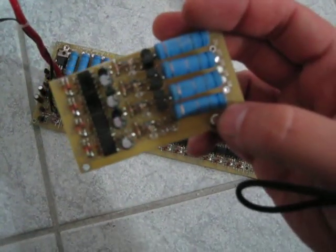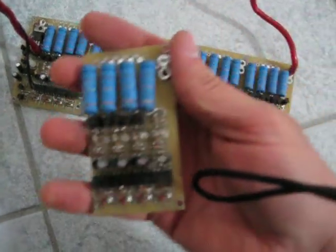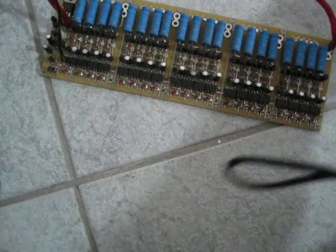So this is where you see the parts on the last channel — I took them off. I tried to use the board with the component missing, but it wouldn't work properly. So, considering you only need 20, I just cut it off. Believe it or not, this took me about an hour to figure out, because the missing components wouldn't make the BMS work properly. So I scrapped that piece.